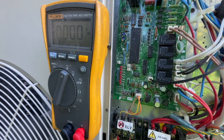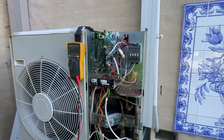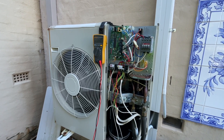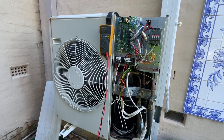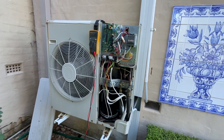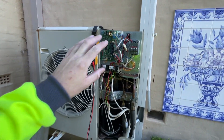There are no lights out here and it's not sending any power to the contactor. I googled how to put this thing into test mode, went inside and put it into test mode — the indoor fan runs, but nothing out here.